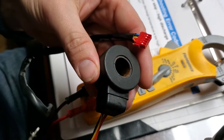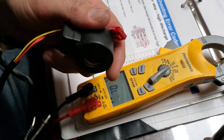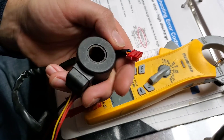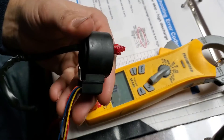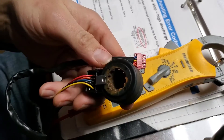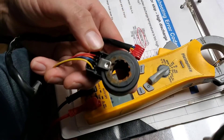What was happening was that we had high discharge temperature because the EEV was not operating correctly — it was either flooding or starving the evaporator coil. That was causing the suction pressure to go to zero, to a vacuum in cooling mode, and in heating mode the head pressure was going to 600. Before I got to the EEV stepper motor and determined this was the root problem, I ended up having a bad compressor because too much high discharge temperature caused the compressor to fail.